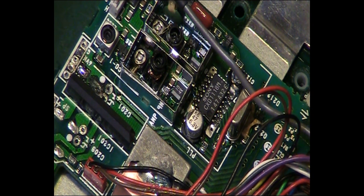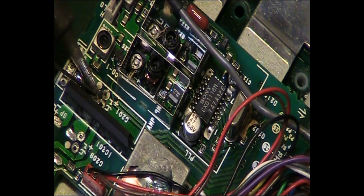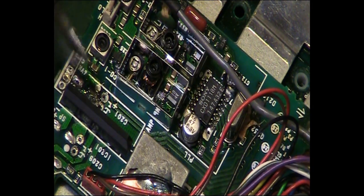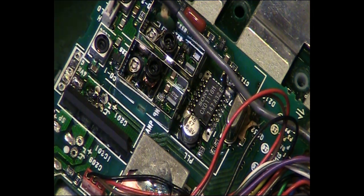What we'll do is go in with some fresh solder, and we'll just put some fresh solder on there first, if we can. Just to help. Ugh, the smell. Yuck. There we go, we've got some solder on there. We'll just try and wick that all back up now, and hopefully get them pads fairly clean.